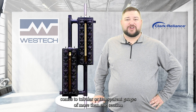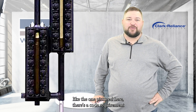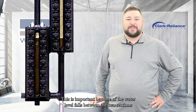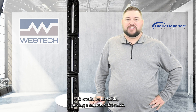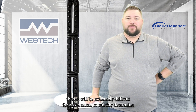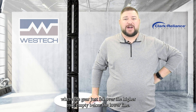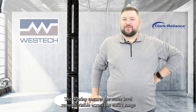When it comes to tubular or transparent gauges of more than one section, like the one pictured here, there is a code requirement that there must be a minimum of a 1-inch overlap between sections of the gauge. This is important because if the water level falls between two sections of a non-overlapping sight glass, it would be invisible, posing a serious safety risk. Water is clear, air is clear — if the water level is between sections, it would be extremely difficult for an operator to quickly determine whether the gauge is full, over the high alarm, empty, below the low alarm, or operating perfectly fine in the middle of the range. The overlap ensures the water level remains visible across the entire range.